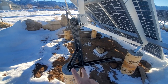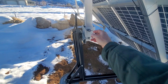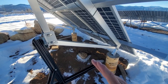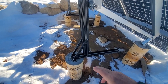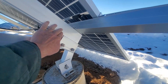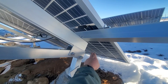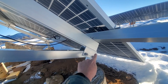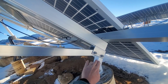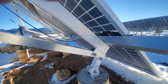These are just RV jacks — not the A-frame or scissor type, these go flat down and lift up. These bolts over here are slightly loose to allow everything to bend, since you're twisting this whole bracket up at a radius. I used concrete anchors to tie those in. I ended up sliding the whole rack forward because the panels were hitting the ground, so I had to loosen the bolts underneath and slide the frame back. The tilt bolts are also slightly loose so it can radius, and it's withstood a few windstorms already.